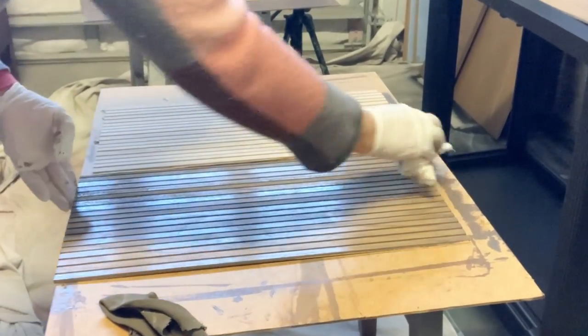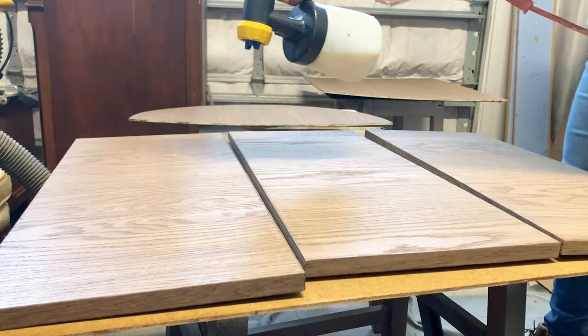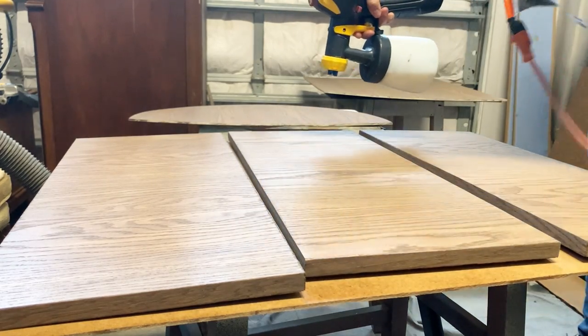I'm gonna repeat this, make sure that your oil-based stain is completely dry before applying a top coat, so a couple of days. For top coat, I loaded my detail finish nozzle Flexio 3500 from Wagner with high performance flat from General Finishes and applied 3 coats.